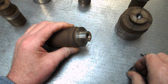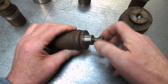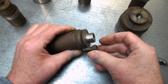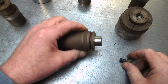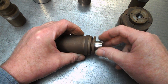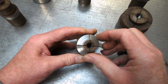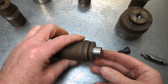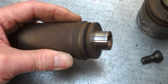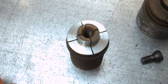The head of the bolt has been turned back to suit so that when that's screwed in it opens it up, and it doesn't even go in very far. You've got a groove here behind where your part butts up against, to give it some flexibility so that the thing will actually expand. And then, obviously, some slots cut in it - they're just rough cut with a hacksaw. Don't need to be straight at all. Just needs to do the job - simple as you like. Handy things to have.